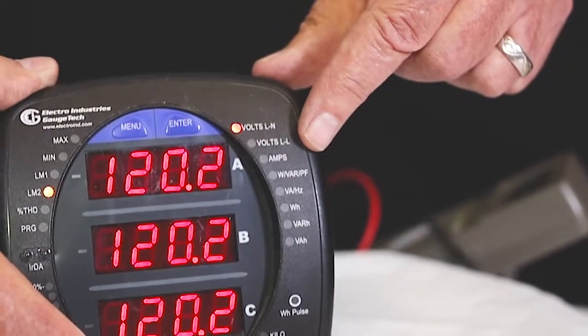If the voltages look good, then go to the amperage readings. Assuming the voltage and current readings make sense, then proceed to the next reading on the meter, which is labeled watts, VAR, and power factor. This will tell us if you faced the high side of the CTs correctly, and whether you've got the high and low wires connected to the meter correctly.